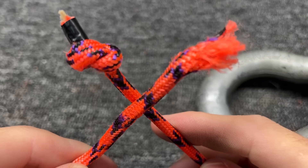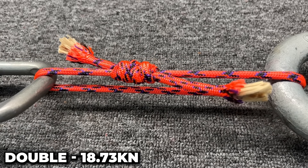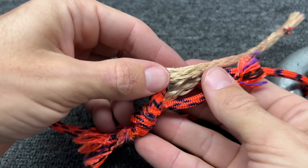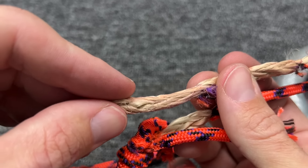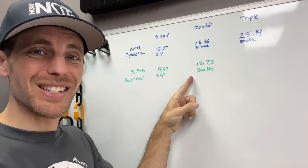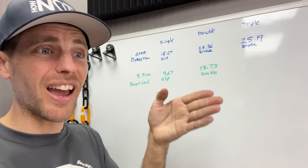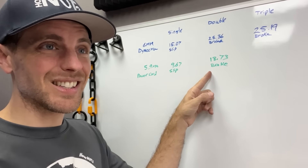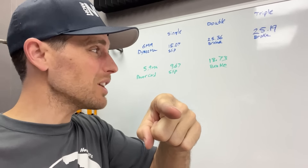That was lower than I thought — nine-ish kilonewtons. Technora doesn't melt, but it sure gets hot. It melted the nylon onto the Technora, so now it's all crunchy. We did not even get MBS in a loop. Normally when you tie things in a loop you get double, and when you put them in a knot you get half, so you usually get MBS when you put it in a loop. But this stuff is just so static — Technora just doesn't handle the knots well, though it handles the heat well.